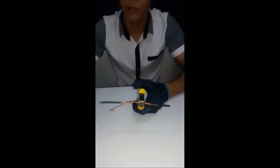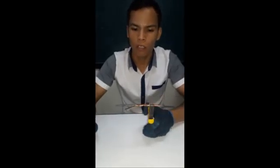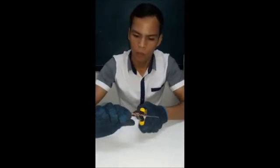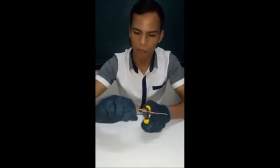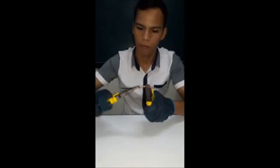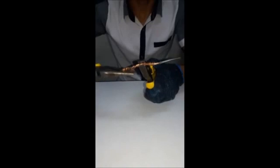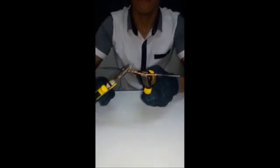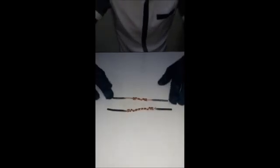The only difference between the Western Union short splice and the Western Union long splice is that the short splice was twisted about two to four times, while the long splice was twisted about four to eight times. We twist the other side counterclockwise using the long nose pliers. Be careful in twisting the wire because it can harm you. Now we have the Western Union long splice.